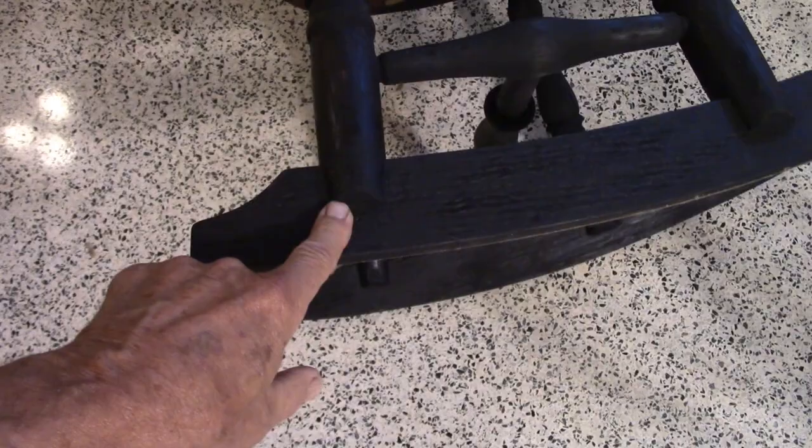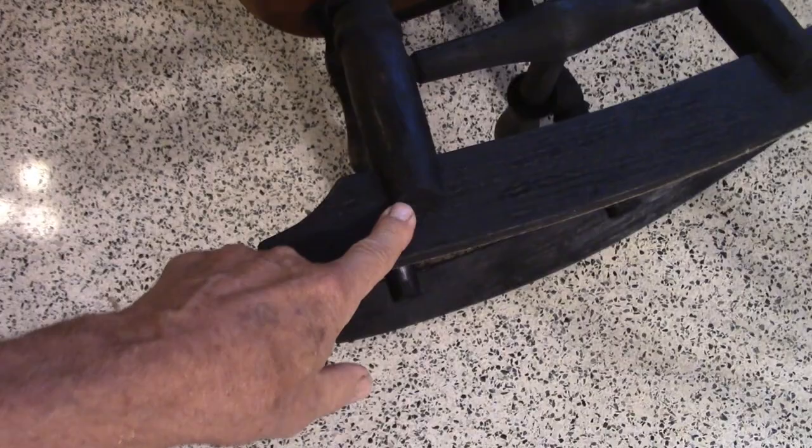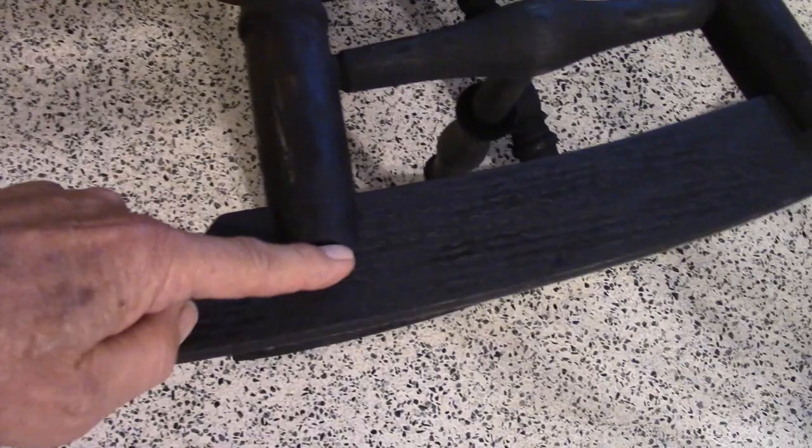The main difference is with the legs. As you can see here, the bottom of the leg is nearly parallel, and that allows a thicker base to be able to attach the rocker. Also, the length of the leg is about 2 inches shorter than a standard chair, to make up for the width of the rocker. So these finish at about 13 inches from the bottom of the chair to the bottom of the leg.